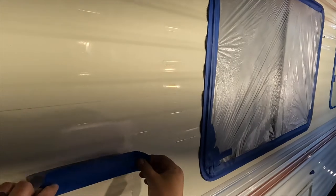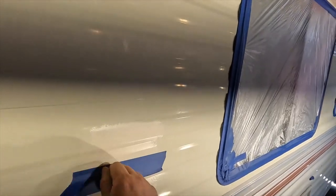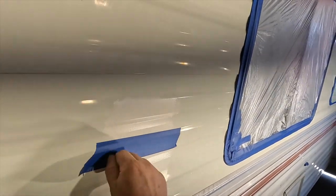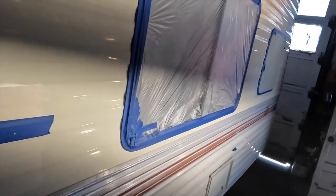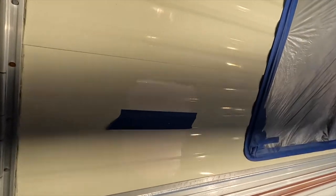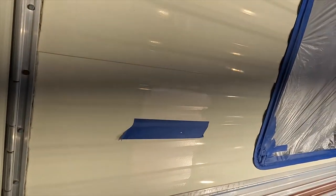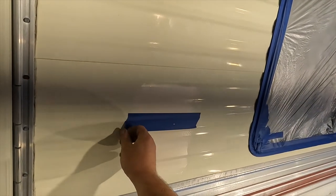I told the people, before we go waste your hard-earned money on this paint job, I'm gonna lay down a test sample for you — just to make sure that we're not gonna have to pressure wash all this paint off, sand it all down, and redo it and start over again. So I put this on the night before. I just used my dirt wax grease remover, wiped it down, and rolled some product on about as thick as I'm gonna be putting it on here — a couple mils thick. And I came back this morning.